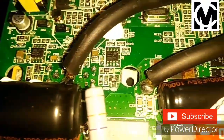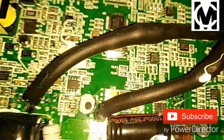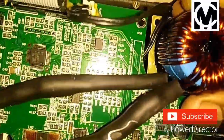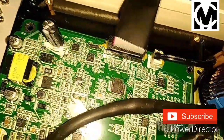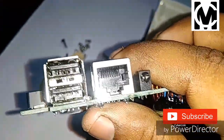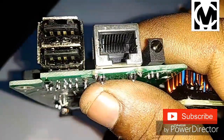All things are good in this circuit and the hardware is very good quality. But the problem is the software in this model, Wiser 2 — I am not talking about Wiser 3 but Wiser 2. Wiser 2 has a problem in the software; it has a bug which stops it from tracking the maximum power point. Sometimes you have to disconnect and reconnect the solar wires to properly track the MPPT, meaning the maximum power point of the solar panels.